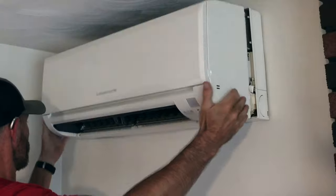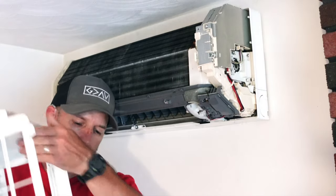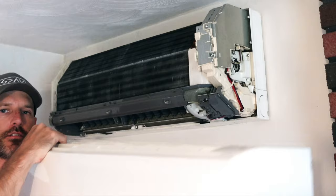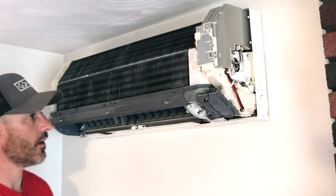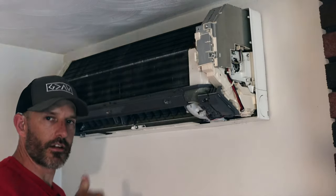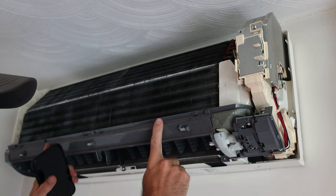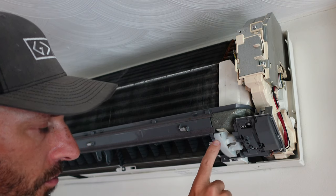Your cover at the top has four little tabs on mine. If you're having trouble getting it off, push down a little bit with your other hand while lifting — it should pop off pretty simply. Right here is your condensate drip pan. You could from here just take some cleaner, dump it down in there, and keep trying to suck it through with your shop vac — that may clear your clog. We can also get inside and look.